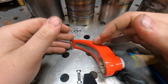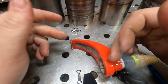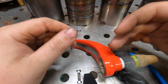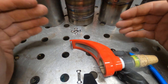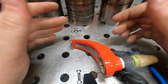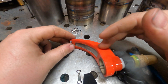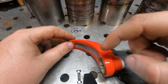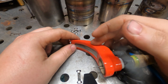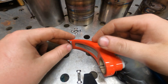Your trailing shield needs 15 to 20 CFH, and your cup needs 35 to 40 CFH. What's happening is you're setting your flow meter at 50 to 55 just to compensate for both sides taking up gas. But when your welder kicks on, all of your gas is going through your cup, so it's not making it to the shield because of the path of least resistance.